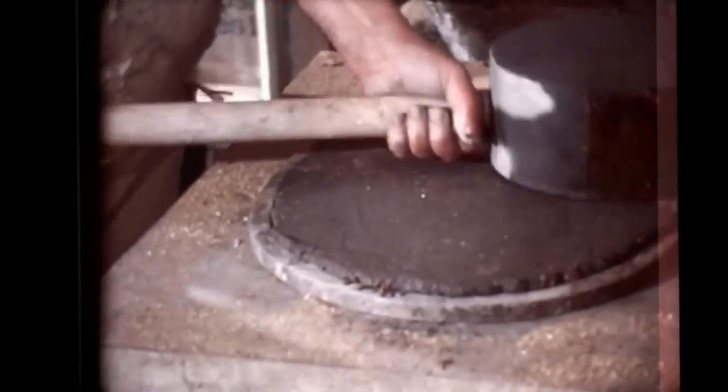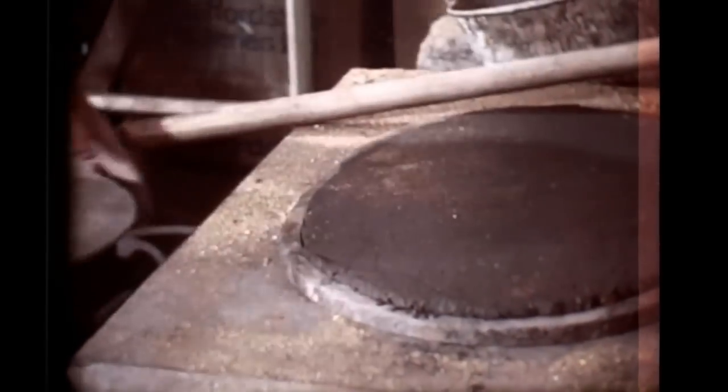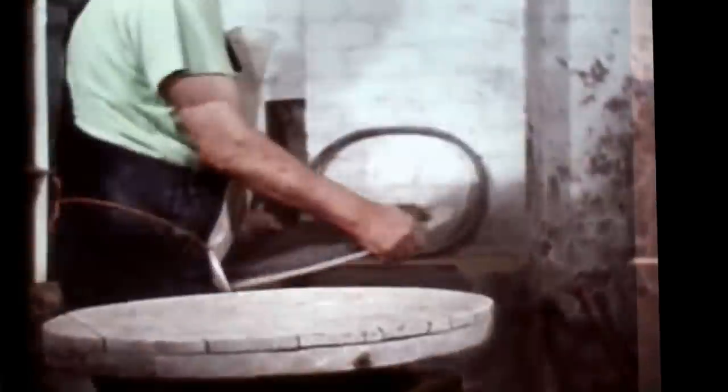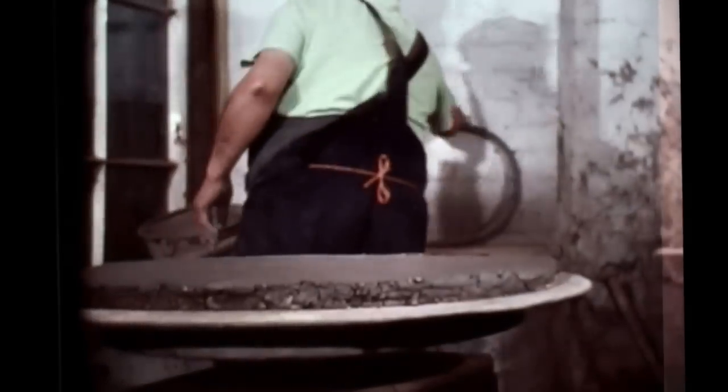You've got eight minutes to fill the frame, mould it in, and cut it out. After you've knocked the bottom — that's an iron plate — you pull the bottom onto the plate and then put it on to the wheelie, ready for the saggar-maker, who'll roll the side of the sagger off the frame and put it on to the bottom.